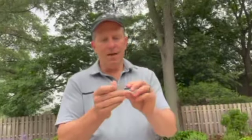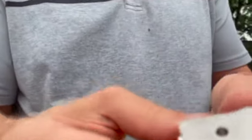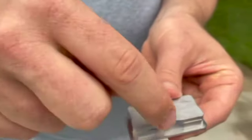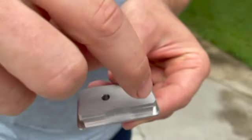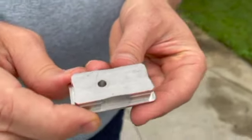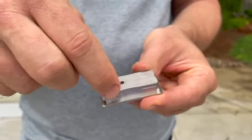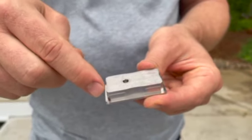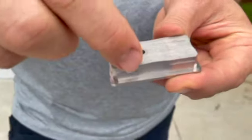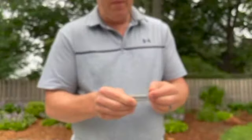The last one is a stainless. Now stainless is a little bit ornery to make work, so there are a lot of design features in this guy that I'm going to go over. Notice how it is relieved out here and relieved on the ends because stainless is so strong that we intentionally relieved it out so that we've only got a few points of contact — here, here, here, here, and here, and a little bit on the ends.